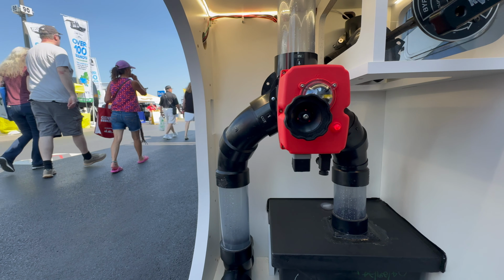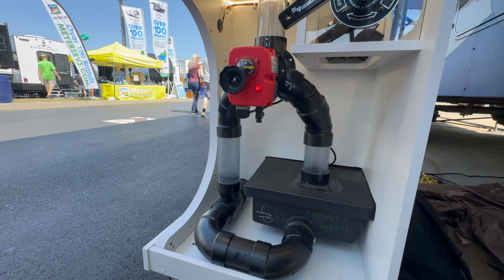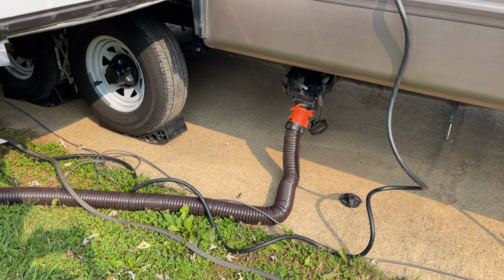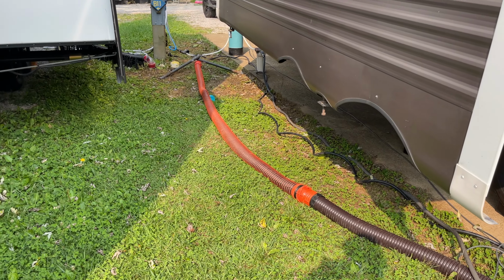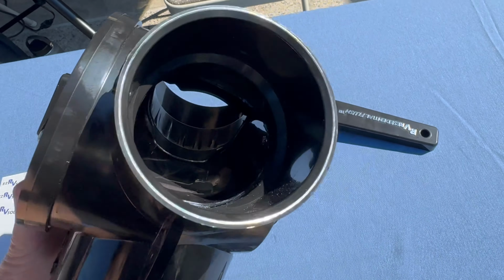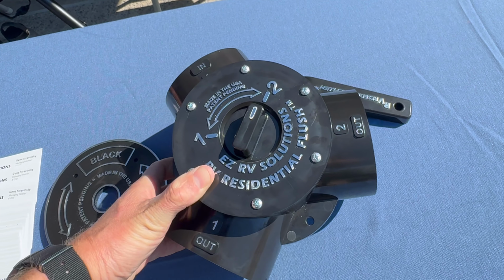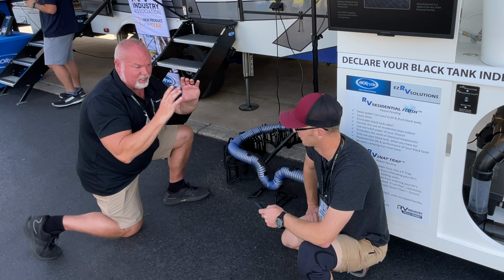You can. Right. But from what we've seen, even with the trap, when you're flushing with a third to half in an RV and with any standard residential toilet, the solids go right to the end of the run. And even if there were any residual left in a 3-inch diameter pipe, that's a big cross section to fill. So if you had some toilet paper or grosser laying in there, it's not going to be 3 inches diameter. And the next time you flush, most of the time, let's face it, the toilet is being used for number one usage. You're constantly flushing and rinsing the hose.